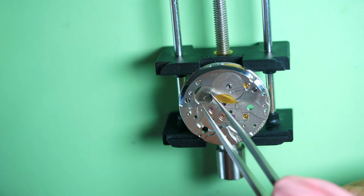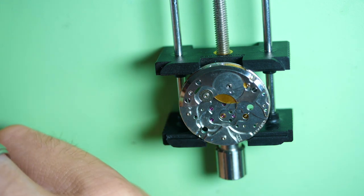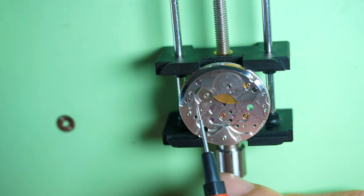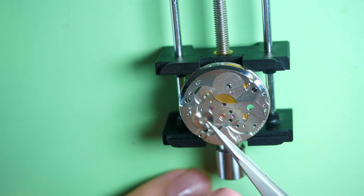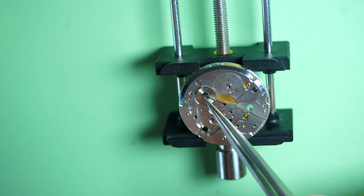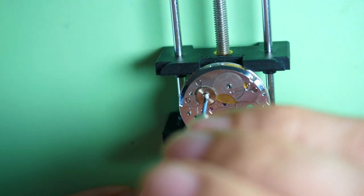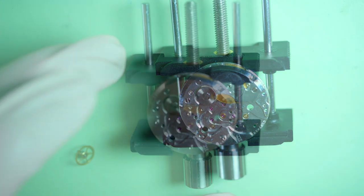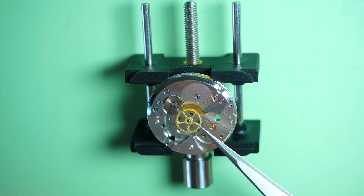Now we start the assembly with the crown wheel. Put the plate and the little ring around it. Before we put the wheel, it's very important to lubricate it — put some 9104 around the pivot point. It's in place. Now put the screw on top to keep it in place. Remember, the screw on the crown wheel in the center is a reverse-threaded screw, so we turn the opposite direction — anti-clockwise to screw it. Let's also put a bit of 9104 on the jewel — the big hole in the center — and put the great wheel.